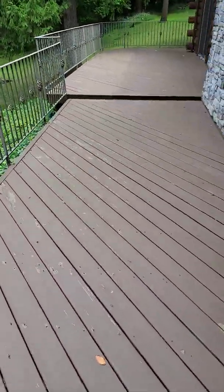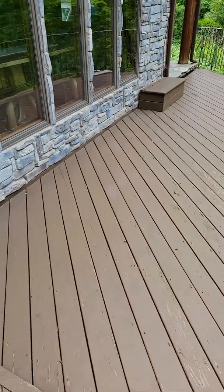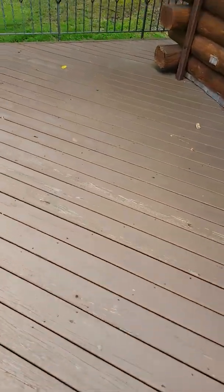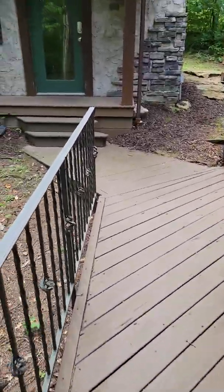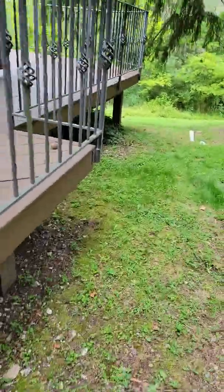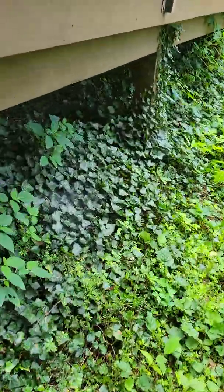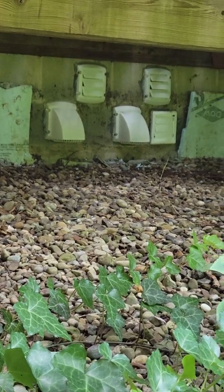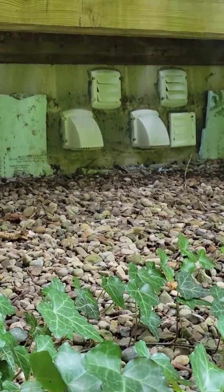Here we are on the outside of the home. This section right here is the old original section. Everything from this corner over is the new basement. Our unit is sitting down right about in that area there. I'll show you where everything comes out. We've got two intakes with removable screens. We have two outlets with flappers on them — flaps that you're used to seeing with your dryer vent and things like that. The two with the flaps up top are open; those are exhausting air. The two down at the bottom are taking in air.